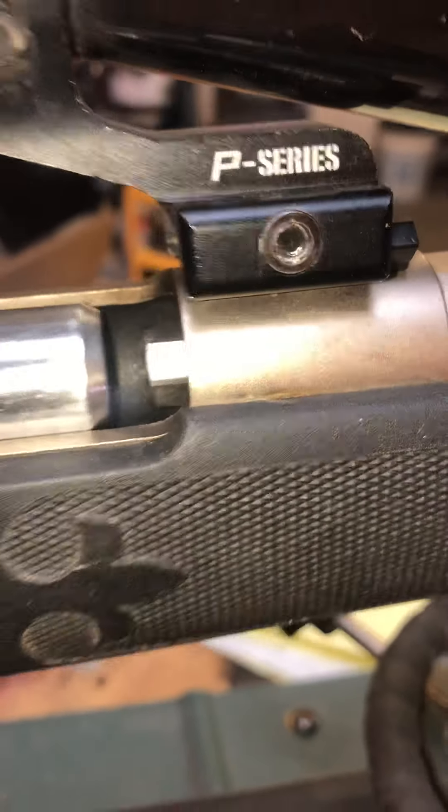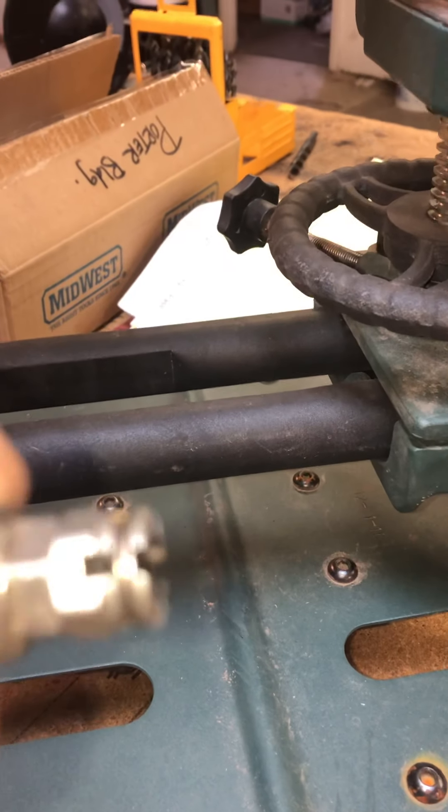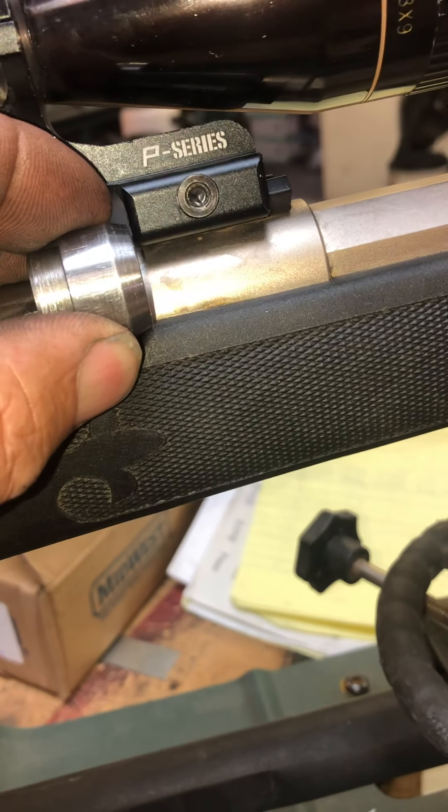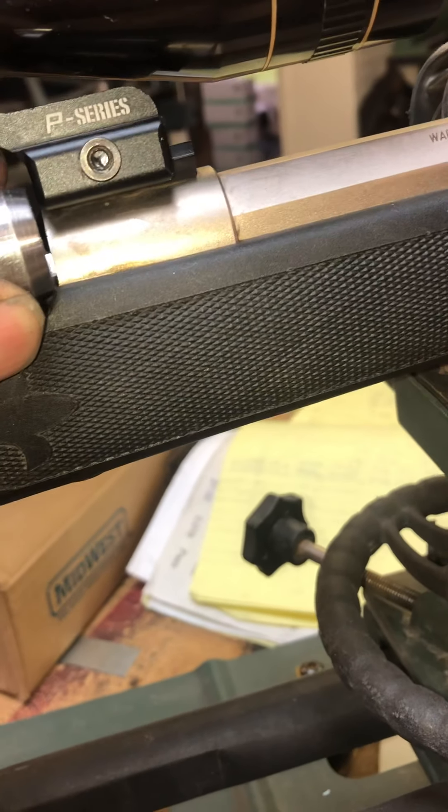The problem is when you discharge this gun, all the gas comes out of these slots in the breech plug, blows off and comes back in your face. I built a nose piece for the gun to go over it — fits on the face of the bolt, goes over the breech plug, catches all the gases so they don't blow out in your face.